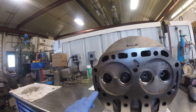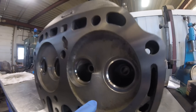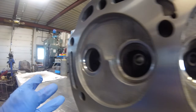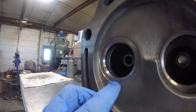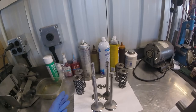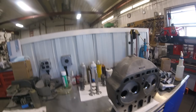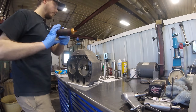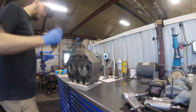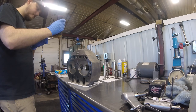Finally we're doing the reassembly on the John Deere A cylinder head. We've got our nice technically three angle valve job — you can see just a little bit of the top angle and a little bit of the bottom angle. We've got everything laid out and we're getting ready to reassemble it. When we assemble a cylinder head, we always put assembly lube on the valve stem. No valve stem seals.